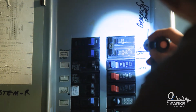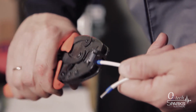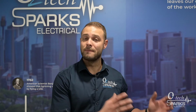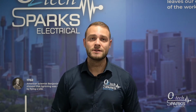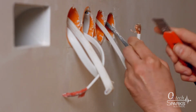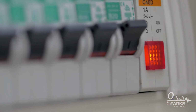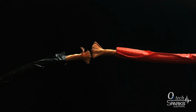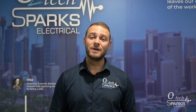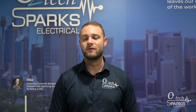The main objective of a circuit breaker is to have overload protection and short circuit protection. Essentially, the amp rating in your circuit breaker is in reference to the cable size of your incoming consumer mains, and what they are is the main cabling powering up your house or your office. Each cable is rated at a different amount of load that it can withstand depending on the size of the cable. Making sure that your main switch at the switchboard is a circuit breaker ensures that in case of any overload current from all the other circuits combined, your incoming cable will not melt or be damaged, giving its protection on an overload. If a circuit breaker does pick up on any overload coming through the unit, it will automatically shut off, providing the protection needed for that cable.